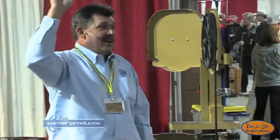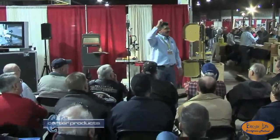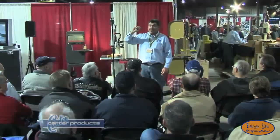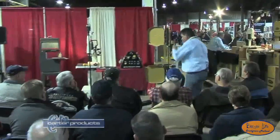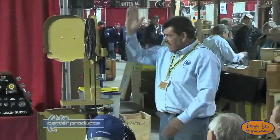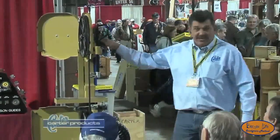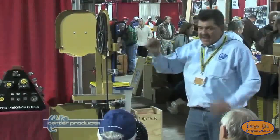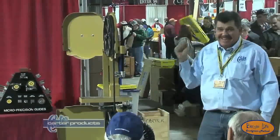How many of you in here have used a belt sander? Probably everybody. When you turn that little knob on the side, what happens to the belt? It takes off. If you don't turn it back, what happens? It keeps right on going. If you line these wheels up so dead perfect, that's exactly what you're going to have, a blade that you can't control and keep in one spot. And when you turn this, you're going to have to back it off and really tweak with it. They are actually angled to each other so that we can turn this knob and it moves and stays.